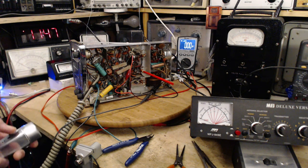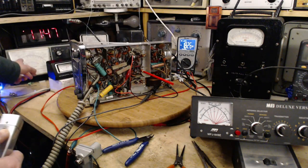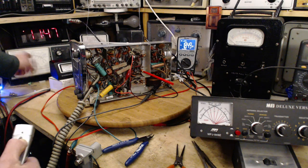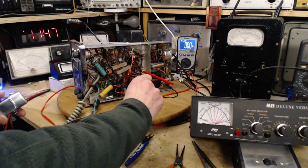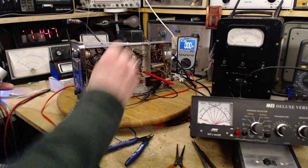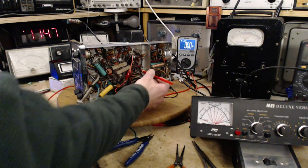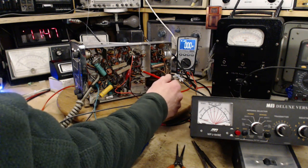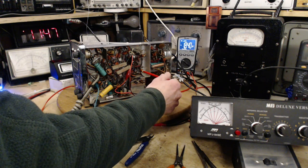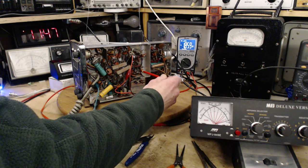First test: 2 watts at 1.8. On the 15-volt scale, we're reading eight or nine volts here for the grid voltage. Now I'll turn this one way and watch the voltage — it should go down. Then put it back and turn the other way — should go down in both cases. I don't think I want to try tuning through resonance. I'm assuming we're at resonance right now and I'm going to tune off.